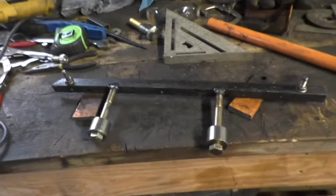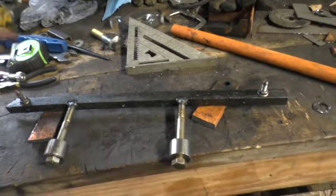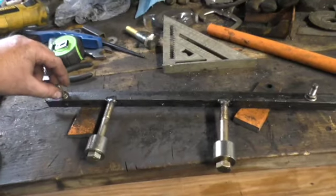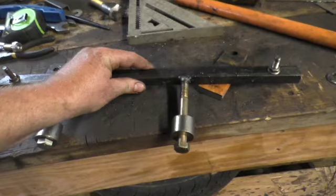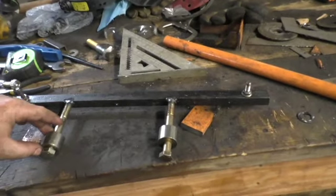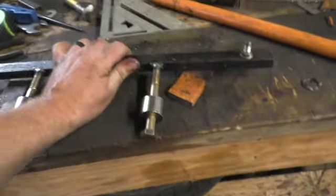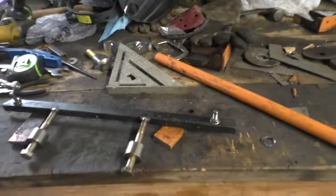So I just made this up. This here will go onto the pump motors, and then this here, there's a connection in between here that when this hose slides front and back will adjust my speed of my hydrostat pumps, and then these here will be welded to the frame, and it'll keep everything rigid and not move around. So yeah.